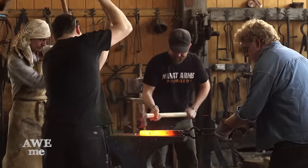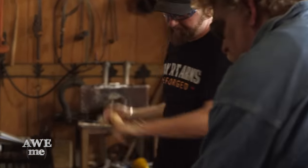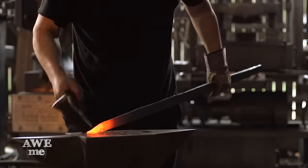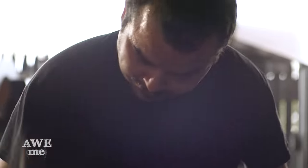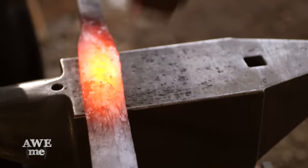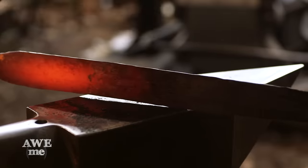As Kerry places the hot steel into the anvil, Sam not only sets the pace, but also the placement for the striking for Illya and I. Sam removes the blade from the hot charcoal and goes to the anvil to refine the tip. Now that the blade shape is fully refined, Sam begins the beveling. He starts at the point and draws the bevels back towards the shoulder. Sam tends to make this look really easy, but even some of the most seasoned smiths struggle through this process.